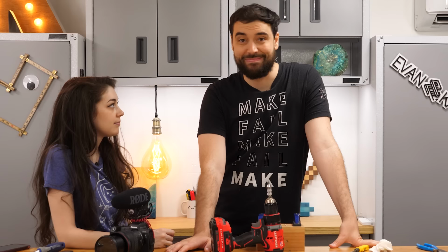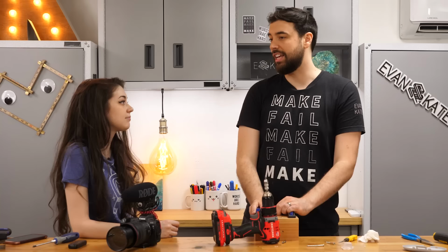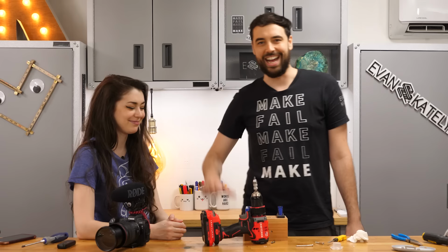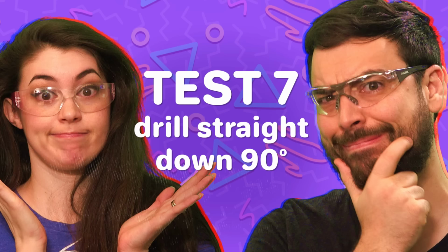Maybe with harder woods, it might be different. Yeah, but who's got like 4x4 thick walnut? That's not super common. I'll just probably recommend pre-drilling. That's the real life hack. That's not even a life hack, yeah. It's just a best practice. Just drill a smaller diameter first and then drive in the screw. That's better than soap. I kind of give it a womp womp. Womp womp, yeah.